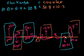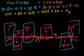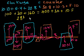And we're assuming our mystery force, which is at a distance of 10, is also counterclockwise. Plus force times 10. And now we simplify — this is just math now. 100 plus 20 plus 160 is equal to — what's 50 times 8? That's 400 — plus 30 plus 10f. 120 plus 160 is 280. So 280 is equal to 430 plus 10f.